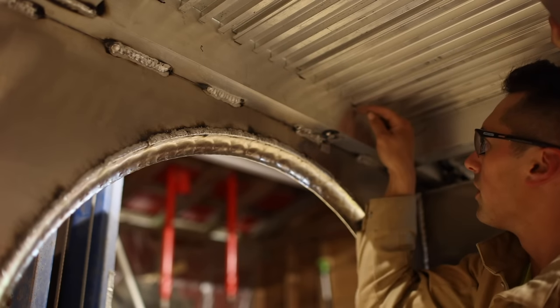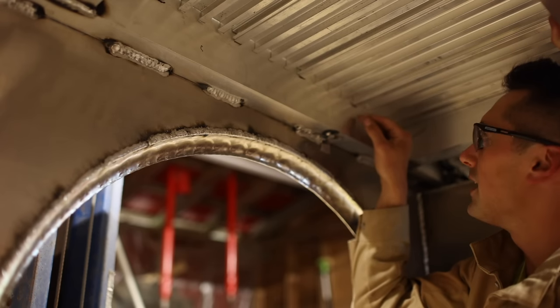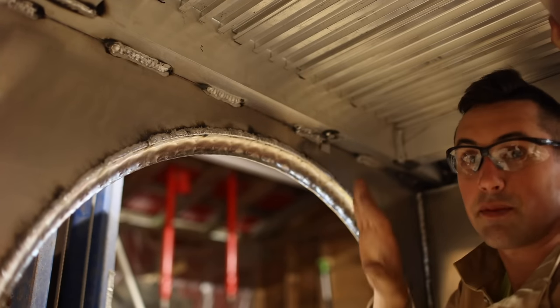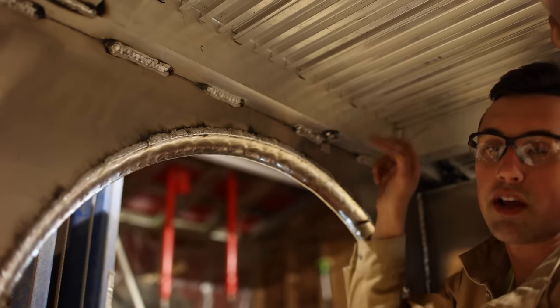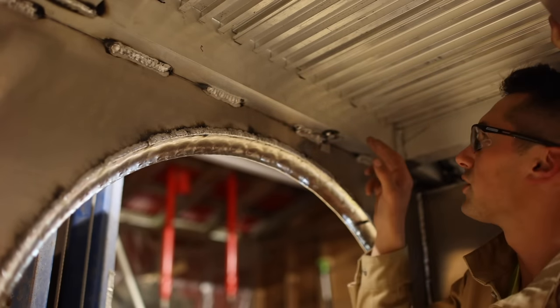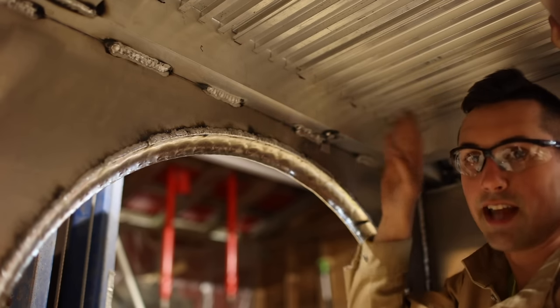I'm going to start welding about 3/4 of an inch to an inch below the joint at full power, and then I'm going to work my way up slowly, and by the time I get to the joint itself, I should be getting full penetration on this big piece of metal, but then when I get to the joint, I'm going to use my thumb on the remote control to pull back the power a lot so that I can tie these two pieces in without blowing through on the rib of the deck.